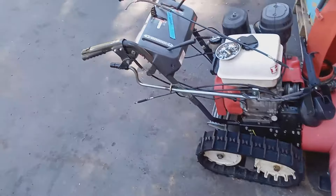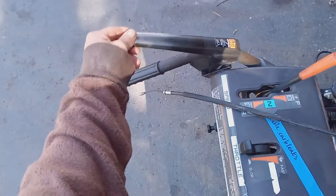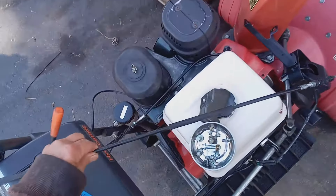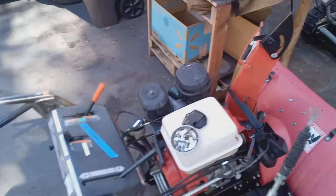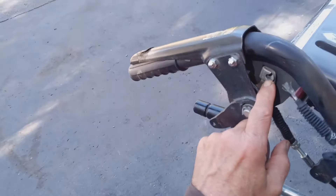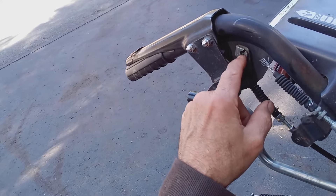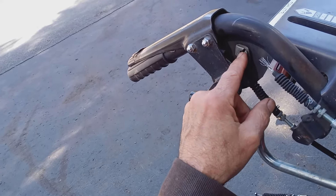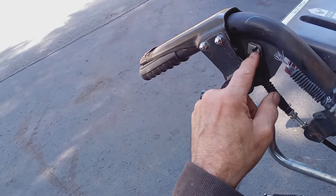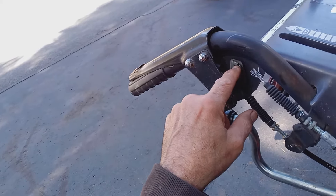He said it wouldn't drive the handle. See that? There's no tension to it. In this case it was fairly easy. Here's the broken cable that connects up here — it broke. I don't see this too often. The reason why this probably broke is that when it was in the slot, it was kind of frozen in there so the cable was rubbing against metal. So it's really important to keep this lubricated, which I'll show.